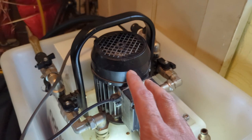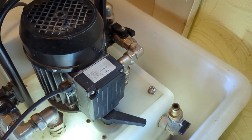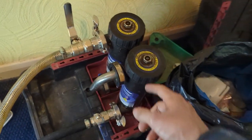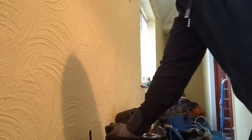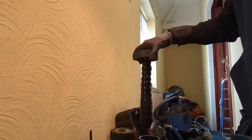The hour's up — we've finished circulating the whole system and I've finished isolating all the radiators as well. Turning the heating demand off so the boiler won't fire anymore, turning everything off, and we'll get these open and see what they're like inside. And whoa — that's a lot of sludge in there.